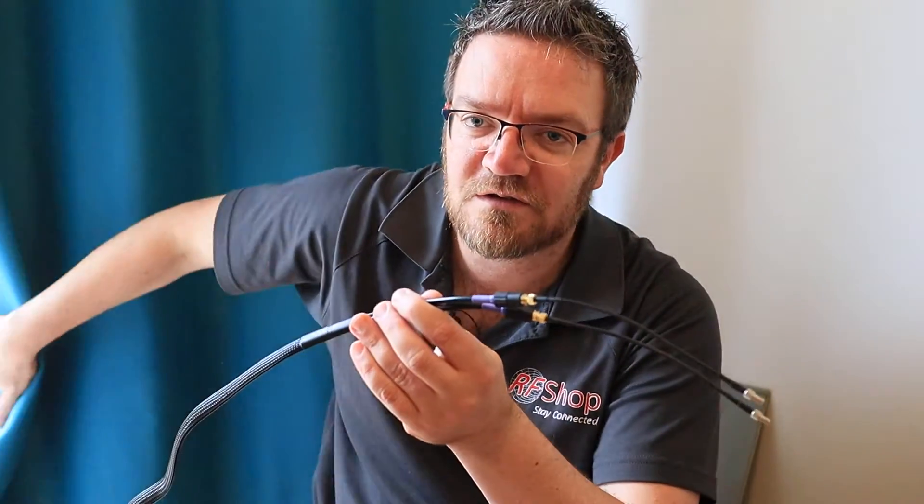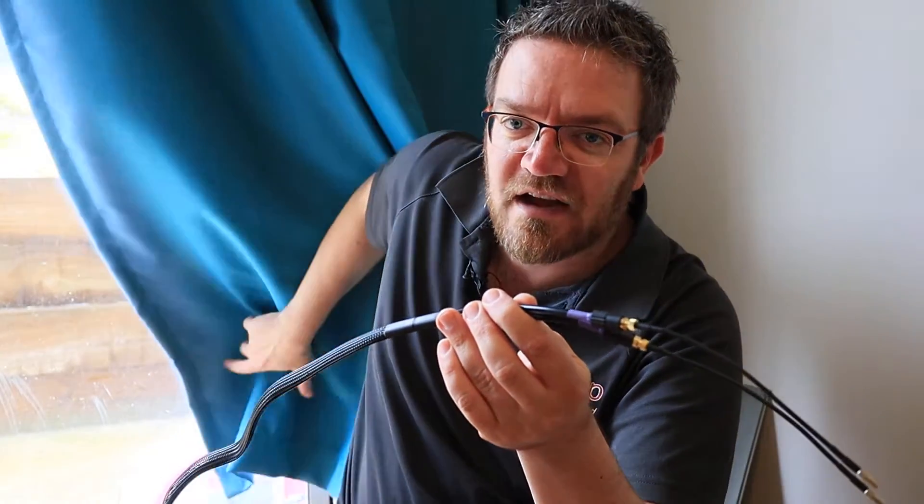Once I've done my field tests at Hallett Cove, I may actually want to open up this device and have a look inside at the antenna routing — whether there are extra antennas and whether specific antennas are routed to the two TS9 ports. But let's hold that for now. So I'm at home in the back room, where I've put the modem on a specific spot on the floor — this is probably something you'd notice from your home as well — I get a fairly weak signal. I have an external antenna routed to the caravan outside, with the MIMO 3 on top of that pink caravan.